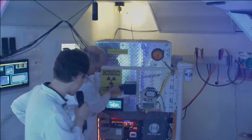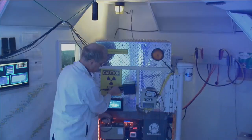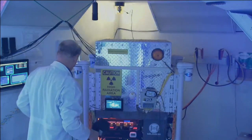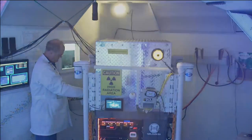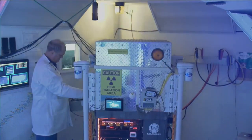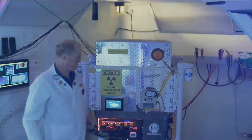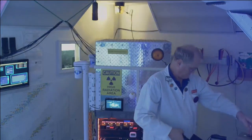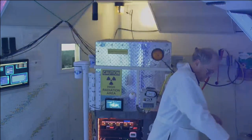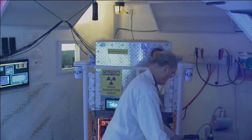Yeah, getting a couple of neutrons out here. I can go ahead and tell you what kind of counts we're seeing on the inside of the reactor when I come over to our old Ortec NIM bin. Let's see here, set that to 10 to the 2. So inside the vessel, I am seeing around, it's 1 second time constant, 10 to the 2, HT is enabled. Okay, we got the tube now.